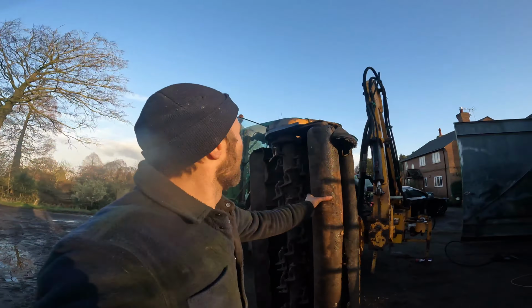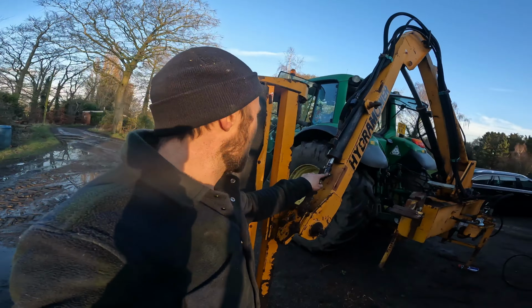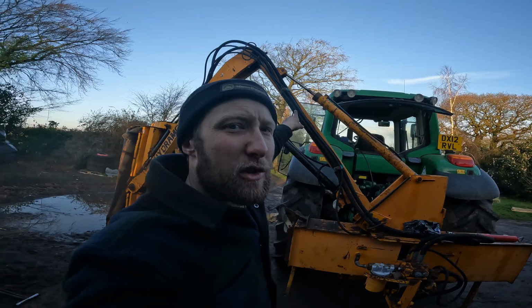Dan's just looking for a bolt. This roller's missing a bolt. We've had this off and drilled it out and put a new bolt in it because the bolt was too small and it was flapping around. We've had the ram off, this ram, as I've just shown you, straightened it in the press. So that seems better. We also drilled out the two bushes, because the bushes had slipped. We had to drill through the grease nipple hole and re-thread the grease nipples on one of the ends. The other end we just cleaned out to get the grease nipples working. And then we thought we'd just do away with this cable block because we just had cables and pipes everywhere. It was only three bolts, and you can just whip it off from there and get it out of the way. So it's all pretty much now set up and ready to go.